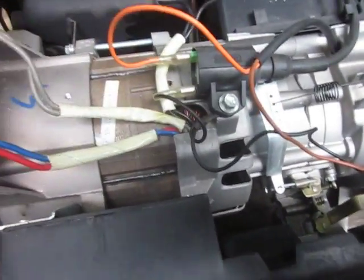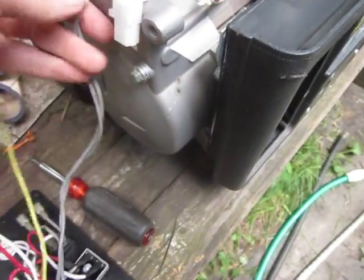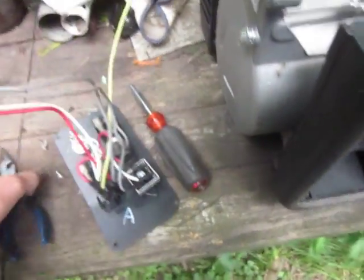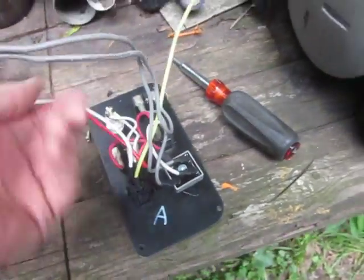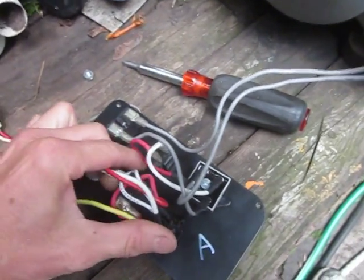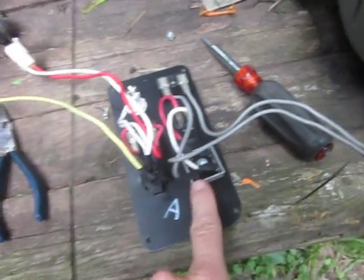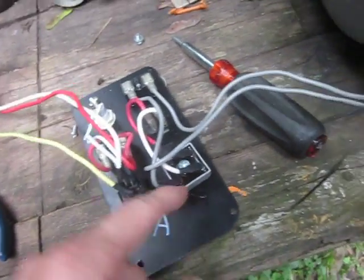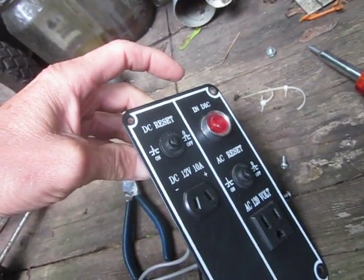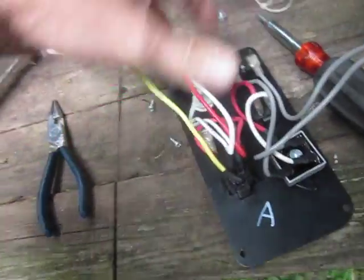Like I say, we've got 2 pairs of wires coming out. Gray wire plugs to the gray wire, and the plugs are different, so you can't cross wire them. I cut the zip ties off the back of the control panel, and what we see here is a mess of wires, but really if you separate them, you'll see that the gray wires go to a full wave bridge rectifier, which are connected to, what do you call this, circuit breaker, and then the outlet.